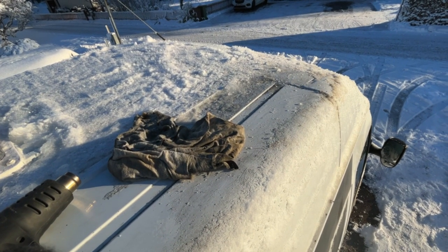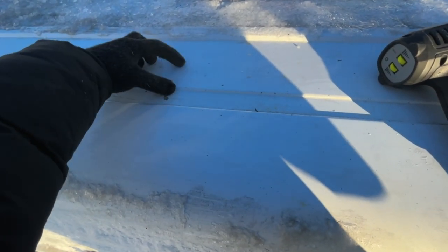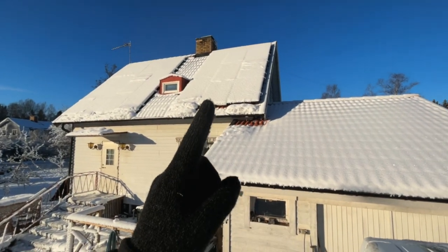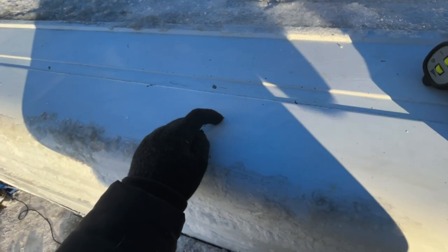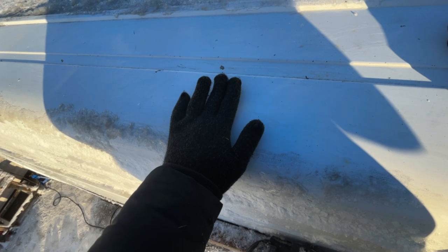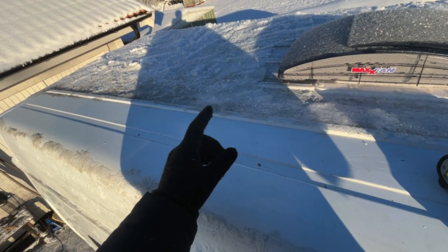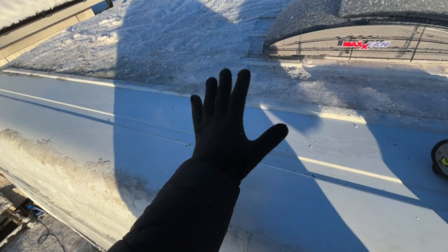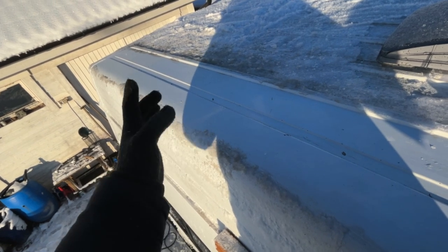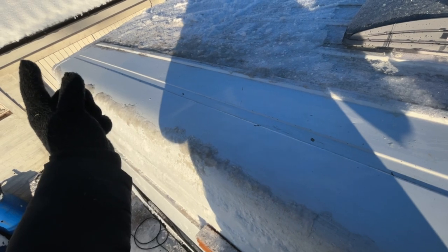So it's snowing and icy, and I'm removing it from the roof just to put up the railing for the solar panels. It's actually the same solar panel rails that are used on a regular roof. Made simple, just put it up with M8 and rivet nuts in the sheet metal, and then bolt it down with some spacer under, like a rubber mat or something, putting on Sikaflex, and then you can put on the solar panels with the solar panel clamps that you use on an actual roof. So made very simple, you can remove it if you want to, and it makes a breeze for install. But now it's minus 10 and we had ice here, so I have to remove it just to get access to the bare sheet metal, so I can put in the rivet nuts and then mount the rail.